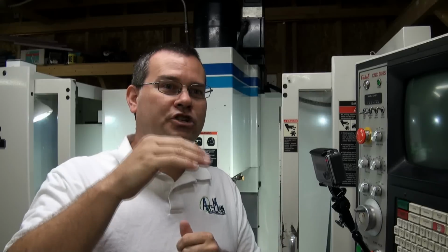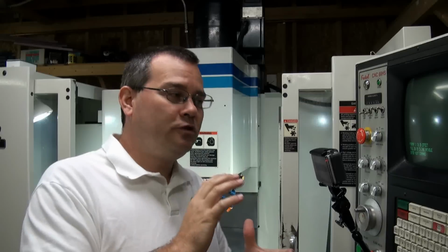I don't ever shift the tool coordinate system Z because I like having my tools referenced to the table. That's the methodology that I chose. Okay? To set the tool coordinate system, that is where the set X, set Y, set Z come from. So if you want to shift the X 1 inch, you'd move it to 1 inch and you'd say set X and it would zero it out, or set Y and it would zero it out. Okay? So it's those set X, set Y commands that are affecting the tool coordinate system.